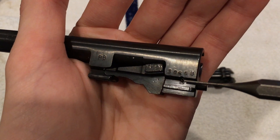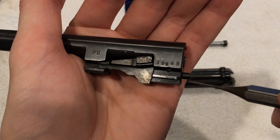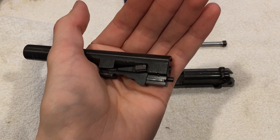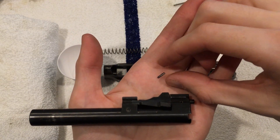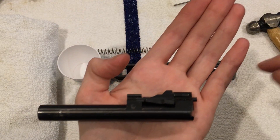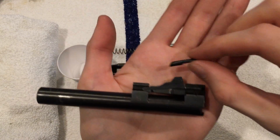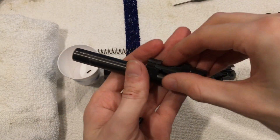You're going to remove this pin right here using a 1/16 inch punch. It'll take off this piece and this piece. I will skip over me hammering all the pins out. Once your pin comes out it is extremely small — I recommend putting them in a cup with all your other parts. That will allow for this rear pin to come out, and then this top part up here.